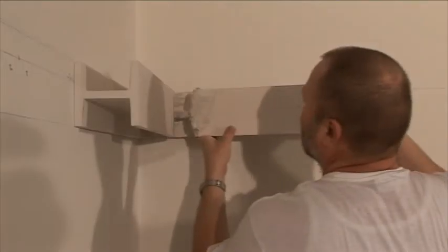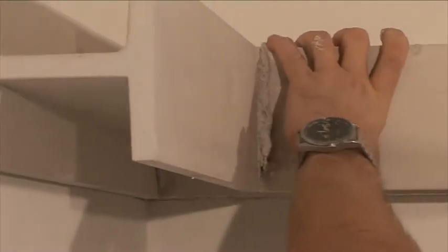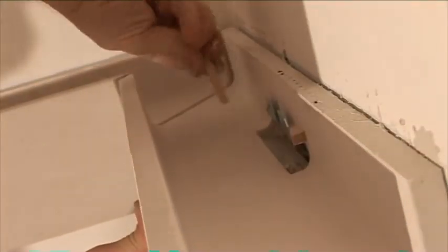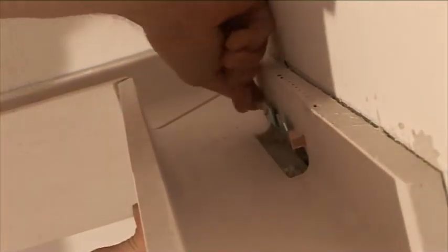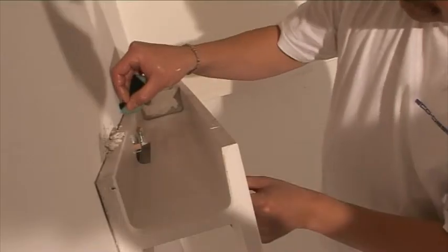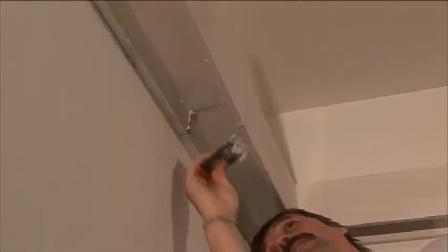Make wooden wedges ready. Slide the body over the holder and press it to the wall. Rocking the body up and down and left and right, remove the surplus glue. Align the body bottom edge with the marked line and temporarily secure the body using the wooden wedges. Wipe the surplus glue with a wet sponge. Using a palette knife, reduce the filler in visible joints. Repeat with all the bodies.